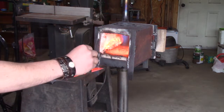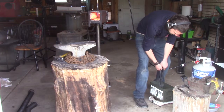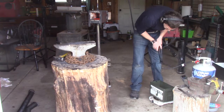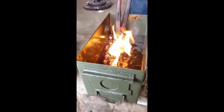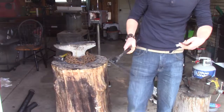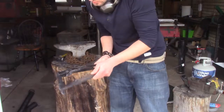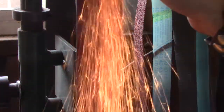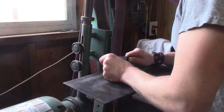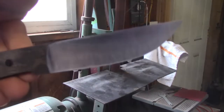You can see the magnet — it's not sticking to it at all, sliding right across it. After I've quenched it in the oil, I use a file. First I got all the scale off, then I'm sliding it across to see if it grabs onto the steel or if it slides easily. If it slides easily, it's hardened. If not then I've got to redo it. But it was hard — slid right across it.